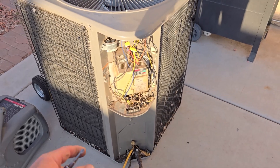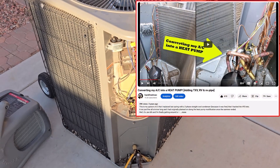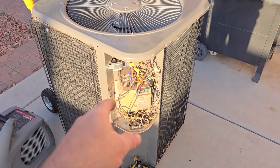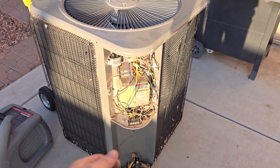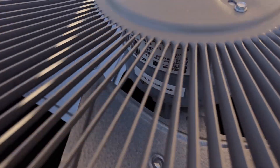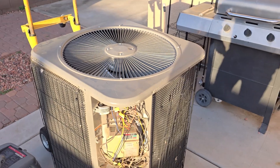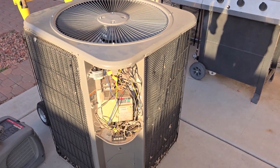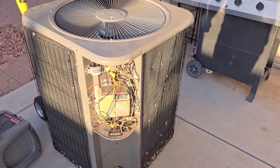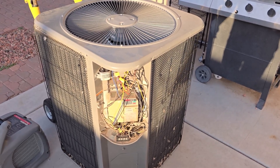So I'm pulling out the charge right now and I start stripping this thing down. Here's the fan motor - we ran the three wires from the motor down to the module at the back. This unit actually - the refrigeration part never failed, the VFD never failed, the compressor never failed. I had to put bearings in the motor, which I have a sticker on there noting that. I literally changed the bearings in that fan motor just because I could - they're ball bearings. I didn't have any issues with anything in this unit that I can remember. For an experimental unit, it ran pretty good.